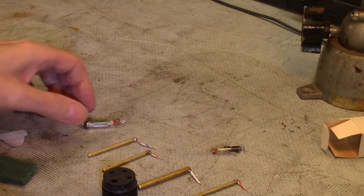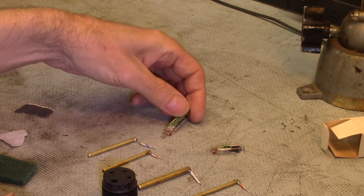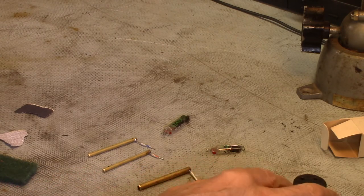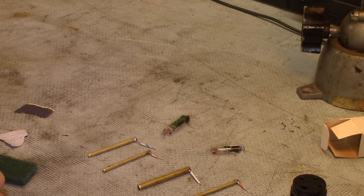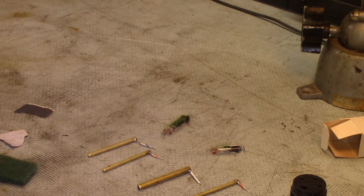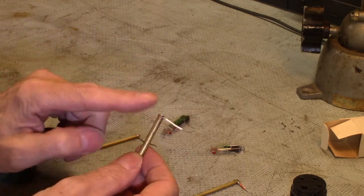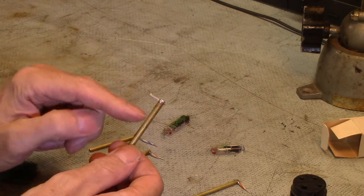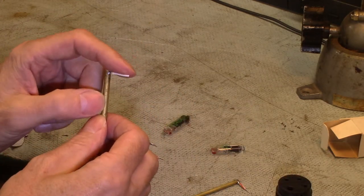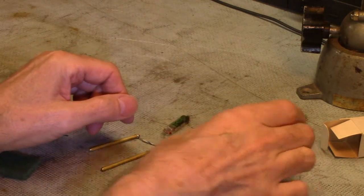The next thing to figure out is that these tubes don't quite truly match the WD-11. In order to have control of the rheostat I'll probably have to put in a resistor in series, a voltage dropper, or maybe a shunt. I'm still puzzling over exactly how to do that. The other reason for routing the wire rather than soldering components directly to the tube is to keep the tube from melting the plastic. It's higher temperature ABS but it might still melt at higher soldering temperatures.